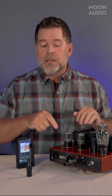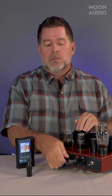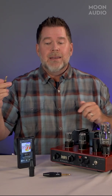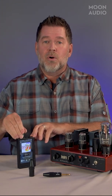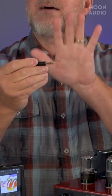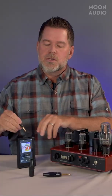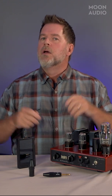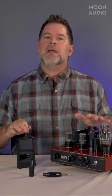So it's always important — and this is part of the reason we put a mute circuit on this amplifier — so that when you disconnect your quarter inch, it's muted and there's no electrical current. Now in a situation like a 4.4mm pentaconn, we've got five poles. There's a lot more chance for overlap with all five poles, and five tabs inside wanting to contact this male connector. So it's even more important in this situation — make sure you pause your player and turn the volume down before you un-jack your headphones.